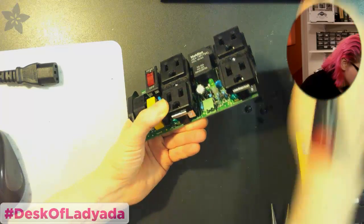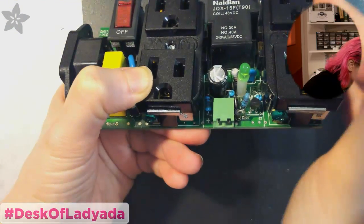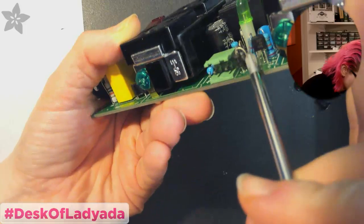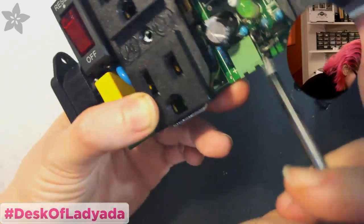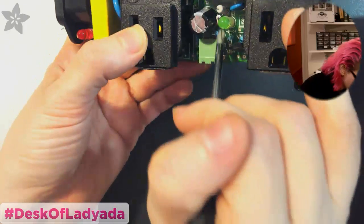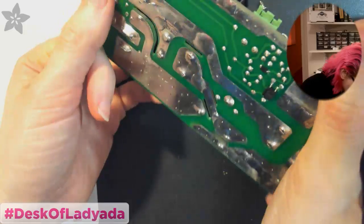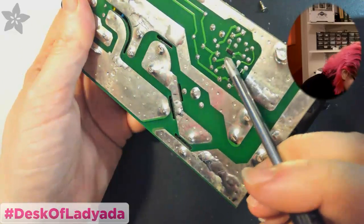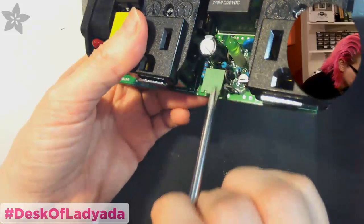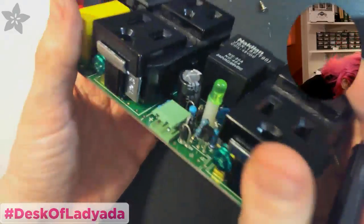There's two. Maybe I'll bring this down because I'm getting close. There's two 1N4000 ones here, so it's going to give you some sort of rectification. And maybe, actually there's 3 diodes, so maybe it's a full wave. And then maybe there's a diode on the bottom, so unclear exactly. But maybe there's a full wave rectifier as well, because this can be controlled by AC, so this might be converting AC to DC. And then over here, we have a KSP44.